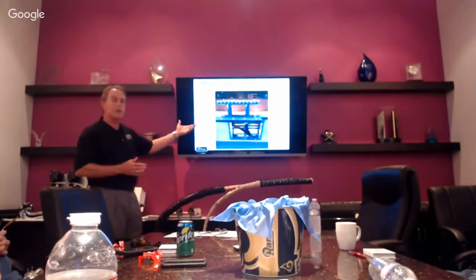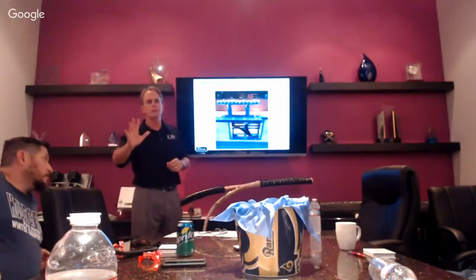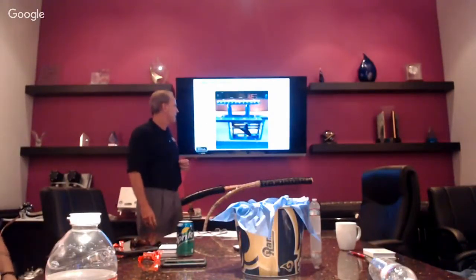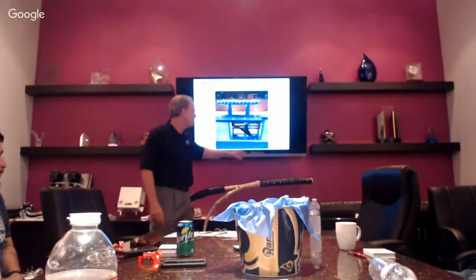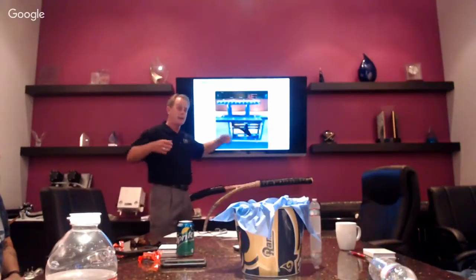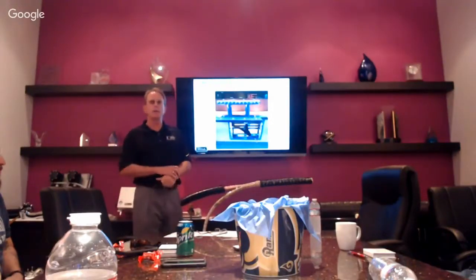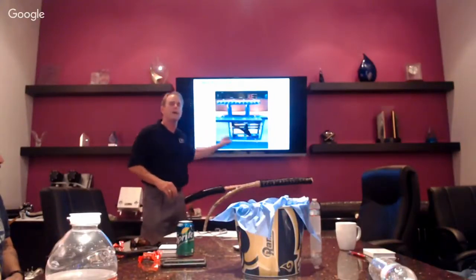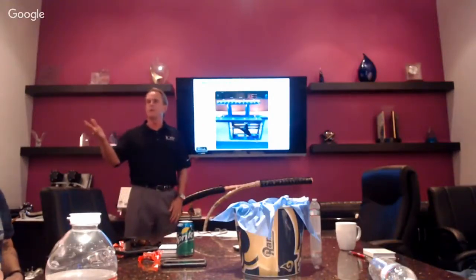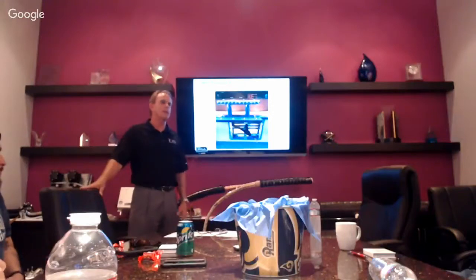This is one that was almost perfect. You notice the blue tape? That wall was completely sealed. And the contractor's idea was we were going to come at it from the customer side, magically get through all these pipes, pull that line up, get their hands up into here to make the connections, and get the crimpers and wrap the tape in insulation. So obviously we couldn't do that. So Matt put the tape on there, they came out and cut it out, and then we were able to do the insulation. And I believe they did a removable, they put a stainless cover over that. Yeah, so that if you want to get in there again, the customer doesn't have to rip everything out.